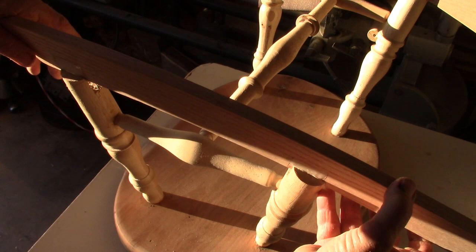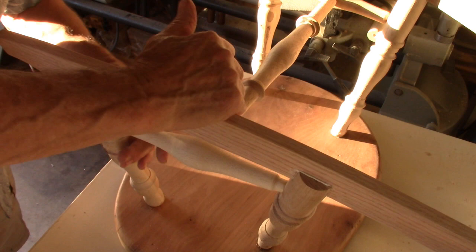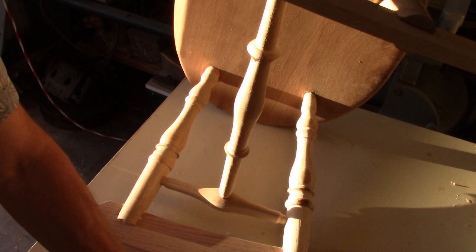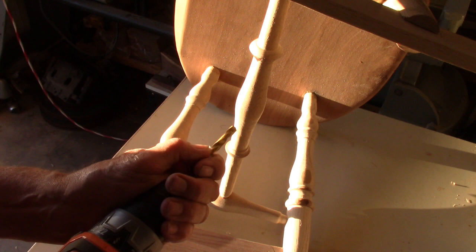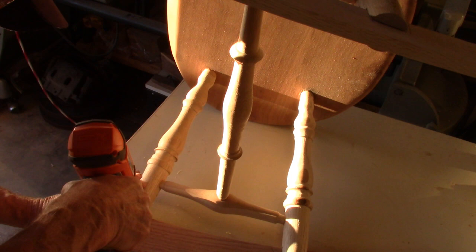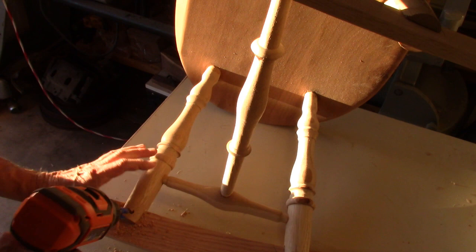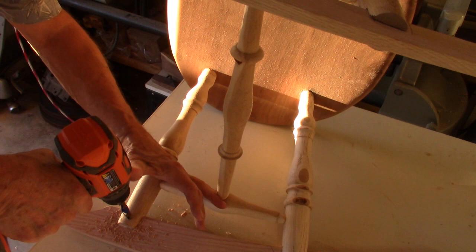Now I have the layout lines on there — that line helped me get it to the exact position that I want it. It was tighter, and that's because the glue already started to make the wood swell. Now what's going to make this permanent is I'm going to pin this. I have the depth marked on the 3/8 bit, but I'm going to start with a quarter inch. We've got to be careful we don't go all the way through — we want it to be a blind hole, so from the outside there won't be any showing. This one is going to take it almost through, but I'll stop at the tape.